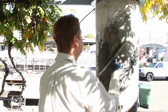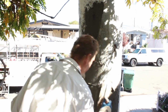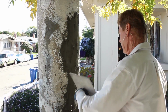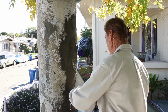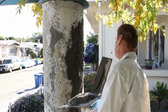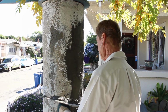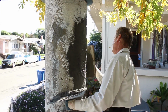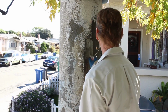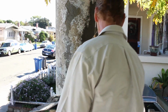And why does this happen, guys? Well, a lot of reasons. The sun has been on this for possibly 90 years, and it beats it up sometimes. If you don't properly maintain your wall, it'll get a little beat up. You should paint your stucco, at least if it's a painted house to begin with, every 10 years for the maximum longevity. If you have a color coat maintenance free house, you never have to paint those, but that's another subject entirely. Okay, so we are following the radius.